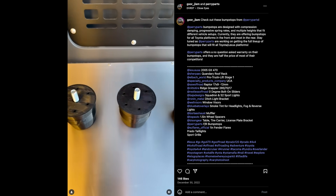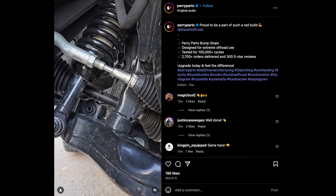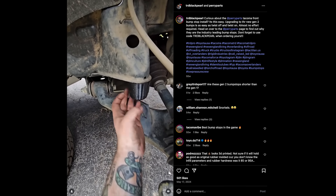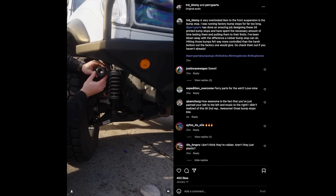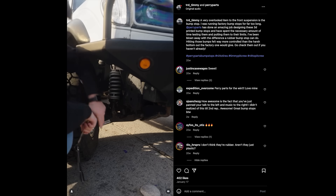It's also worth noting the inserts on the Perry Parts bump stops. They use 3D printed threads, which is kind of odd for 3D printed parts, but it makes total sense in the context of the engineering. They use printed threads because bump stops are in compression — those threads are not being pulled, they're not going to be stripped out in any sort of way. They're being tightened down against the main bar of the vehicle, so literally the only thing the threads need to do is retain the part: hold it on there, make sure it doesn't break off, and make sure it doesn't slide from side to side. You do not have to over-engineer when you do not have to over-engineer. Many people would look at these parts and say we need to embed a bolt into it, but that embedding can radically increase cost, radically increase complexity, and not really help it that much. This part just needs to be screwed on and held there, and since it's being pressed on, those threads will never really be stressed because it's backstopped.